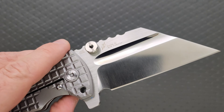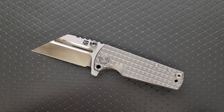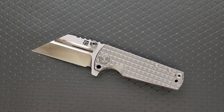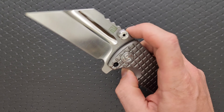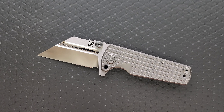This is a Dirk Pinkerton design, if you guys don't know. How are they heat treating the S35VN? The same way they heat treat their M390 — 59 to 61 — which is fine. I kind of like M390. I would prefer S35VN be 60 to 62, but that is a preference. I think M390 technically does have a higher optimal zone, but geometry plays a bigger role in performance. In this case, it's hard to say if the geometry is hindering or benefiting it — I guess it really depends on what you're cutting.